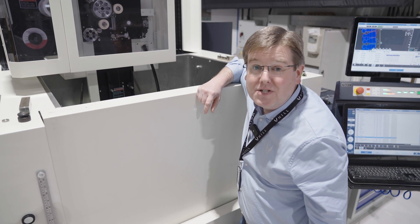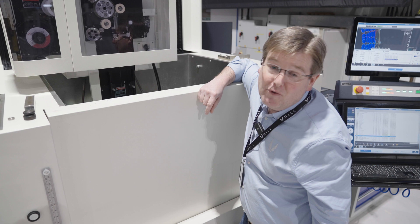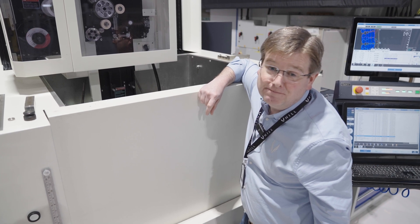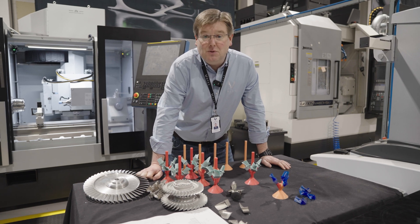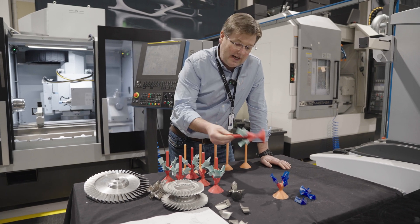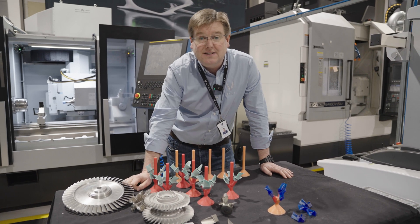The last of the fir tree roots are being cut into that right now, and this will be the very first one that we run on the GT50 test engine. So with the disc nearing completion, we better get busy with blades. We showed you at the last AMA that we've got the first batch of waxes ready to go to casting.